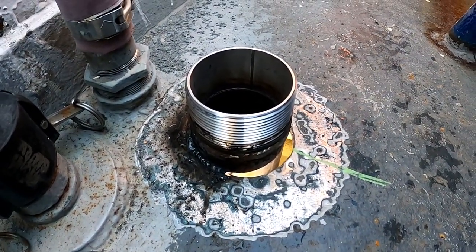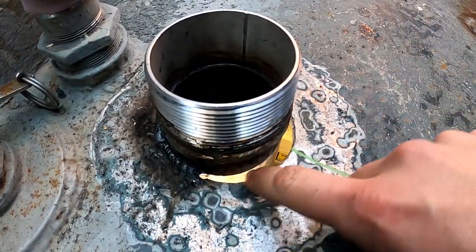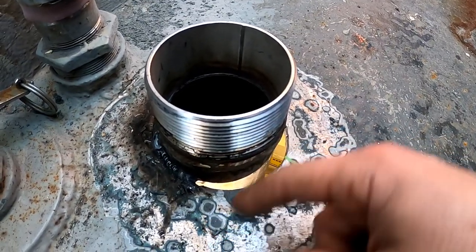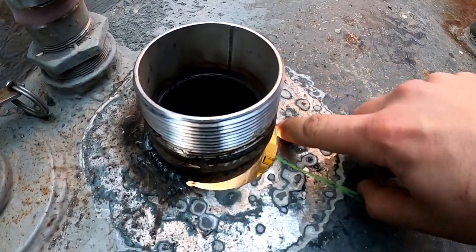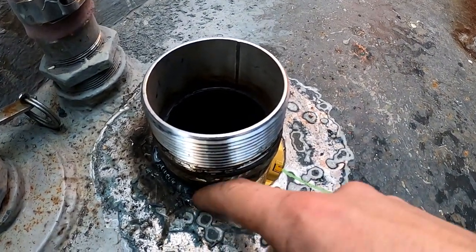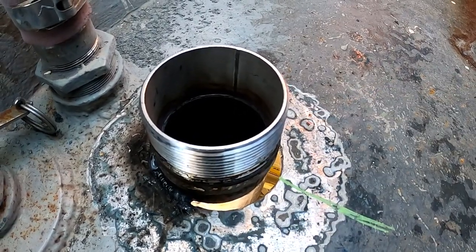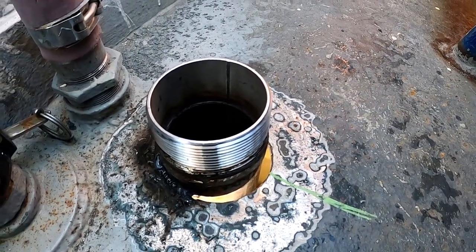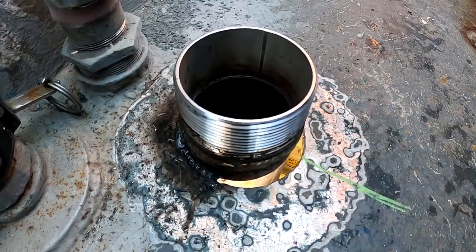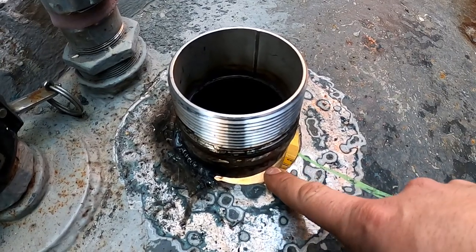Gonna get the suitcase wire feeder up here. And I'm also gonna cut out a backing plate, an aluminum backing plate, and stick that on the backside. I'm gonna fill that gap with a wire feeder. It's not gonna be incredibly structural, but I'll grind it back out and lay a nice 6010 bead over that, using aluminum, because obviously mild steel doesn't stick to aluminum. So it's kind of a good option when you're doing pad welding or gap filling like this.